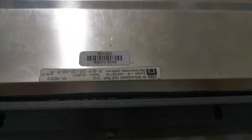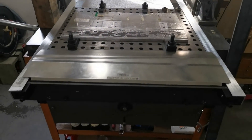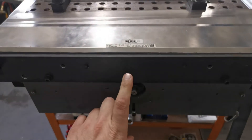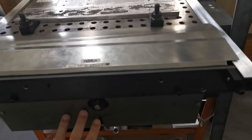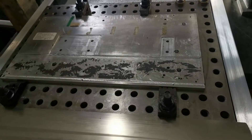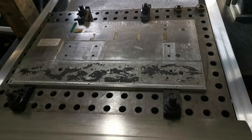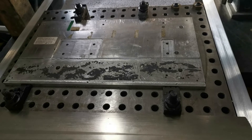I had this HEMA stainless steel way cover left over from the lathe project. What I did is I milled out this piece of steel here, which is the mounting bracket. It mounts to the existing bracket where the motor is mounted. I just used a regular flat piece of steel. This is also the very first part that the machine made for itself — I simply put a piece of sacrificial aluminum down, super glued the piece of steel to the top surface, and then milled out the bracket.